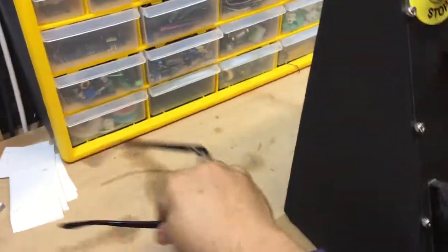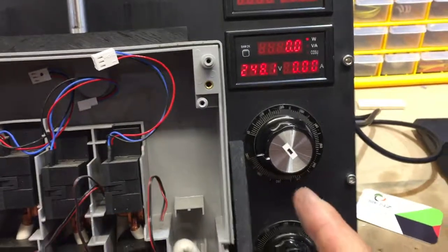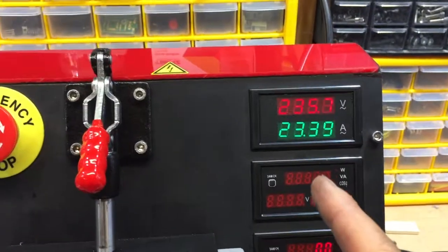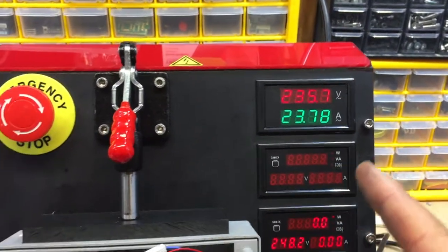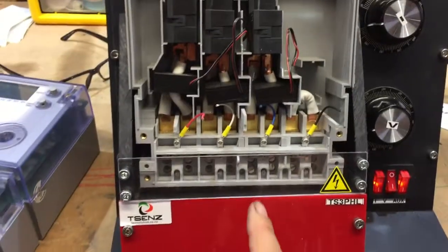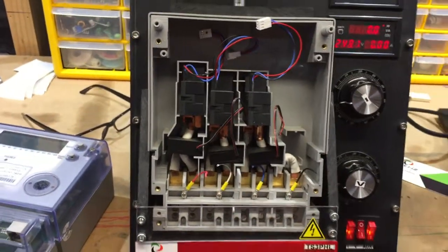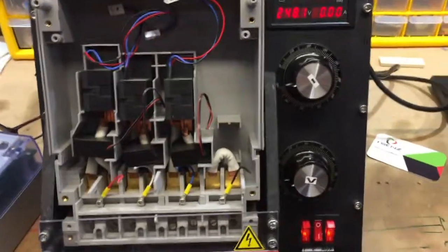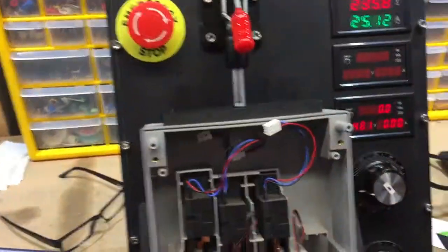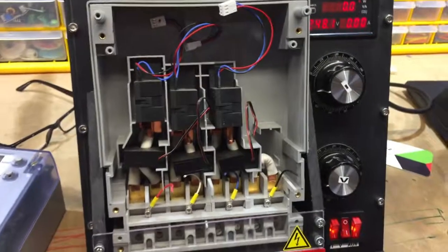If I put another meter in without changing anything, it's the same maximum current setting, but you can see the current has gone up to 23A, while the other one was about 6A. That shows that depending on your burden between your contacts and the relays, you get different values. If you need more current, you basically either put a spacer in between or clean the contacts.